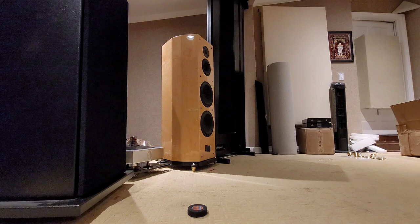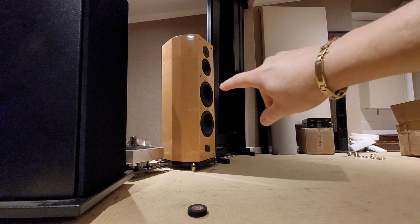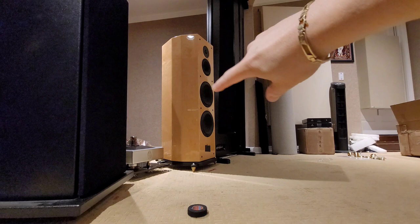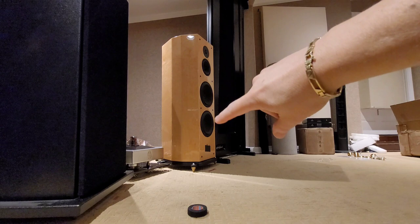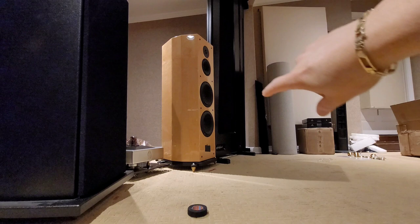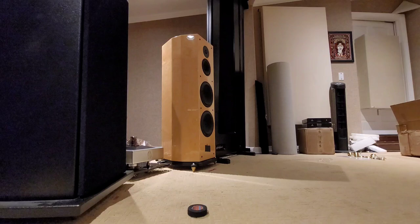and it also has some anomalies with it depending on how tight. See, if you think of each of these as an arch of frequency, right where this arch crosses, they're either going to go at a really steep thing to cut it off, like when this goes down, it's going to be stopped from going too deep. Same with the tweeter. So either that's going to be stopped at a gradual arch, or it's going to be stopped really at a hard, really like a cliff, and that's a higher order, they call it, crossover or a slope.